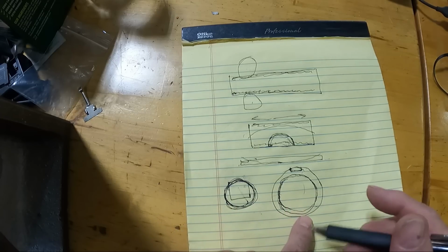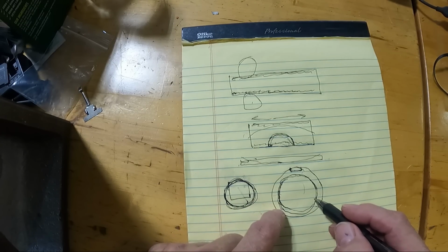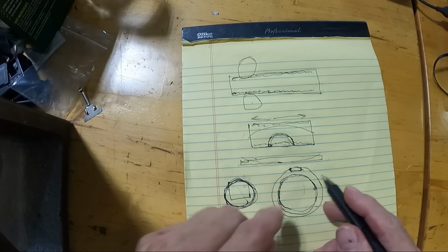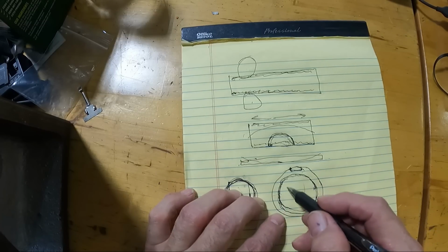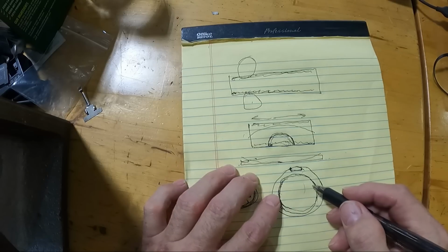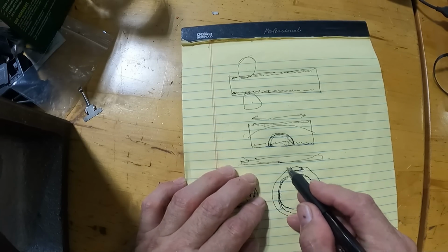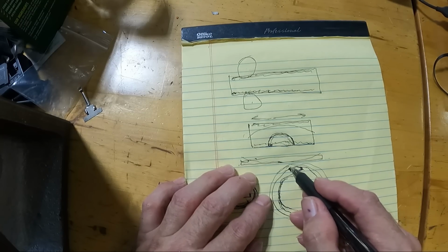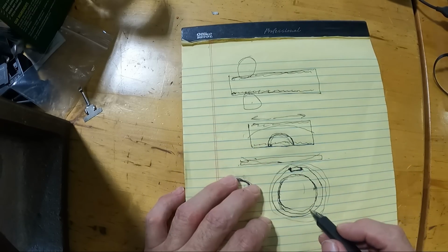See, the better process would have been to do this turning and milling and leave some stock in the bore, and then come back and finish that bore after we did all those things. In fact, I think we had to re-skim the bores after we did it. But see, this is relieving the stress. You've got these compressive stresses all the way around this round bar, but then you cut into it and you relieve it, and the thing just wants to change shape on you.